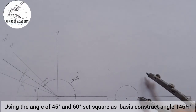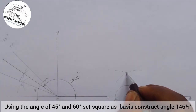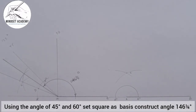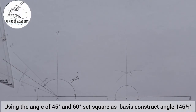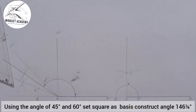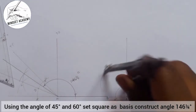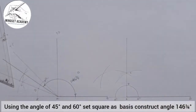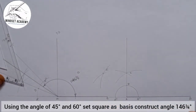With any given radius, I'll place the compass at A-prime and strike an arc, then at A-prime-prime and strike another arc. Where they meet is point C, and I'll draw a line passing through point C from point A — this gives us 90°. Now if I bisect 90° and call the point where it cuts the semicircle point D, I'll bisect between D and A-prime-prime, since D and A-prime-prime both equal 90°. I'll place it on D and strike an arc, then on A-prime-prime and strike another arc. Where they meet is point E.